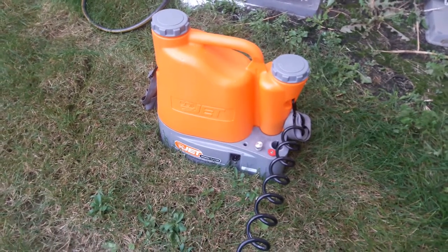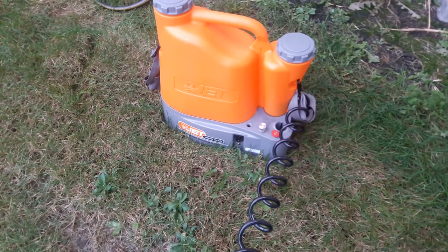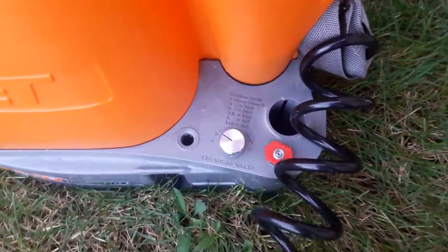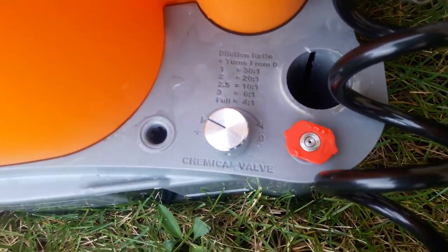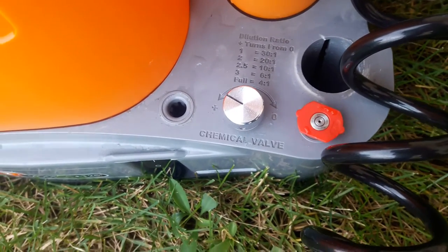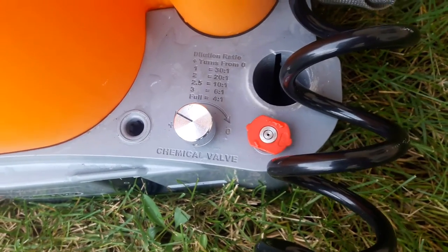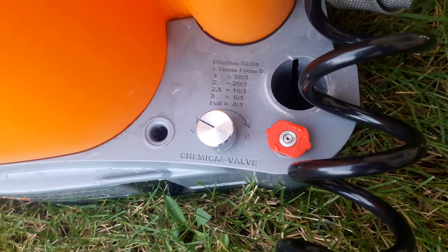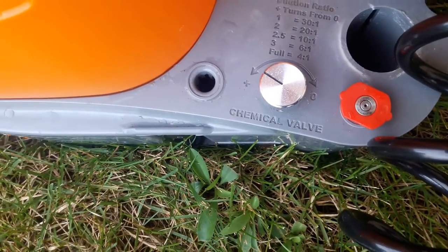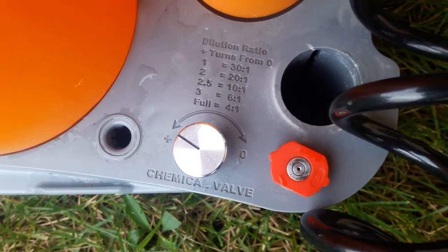In this video I will be using the CoilJet model CJ125 coil cleaning system. It has the soap mix nozzle right here. It tells you how much to add, and it took a little getting used to because when it came from the factory this was cranked down about 20 times too hard. I unscrewed it and basically I just do about two turns to the left for positive — that's about a good enough mixture for soap.